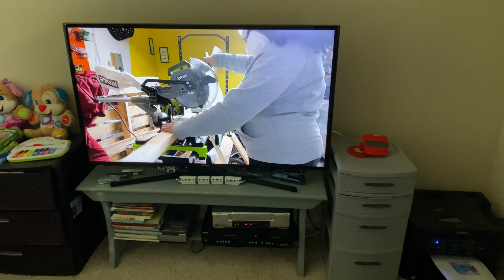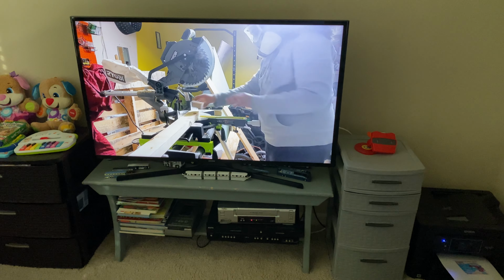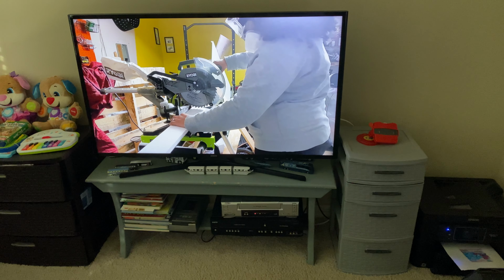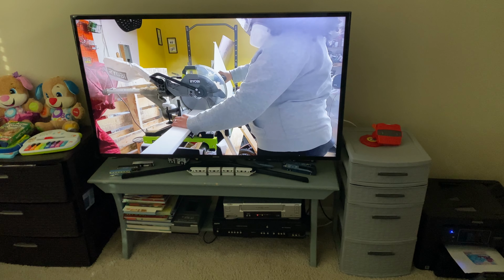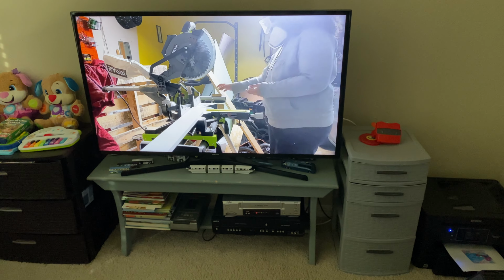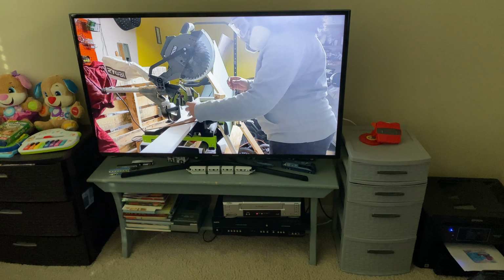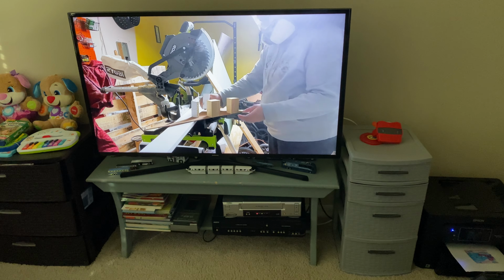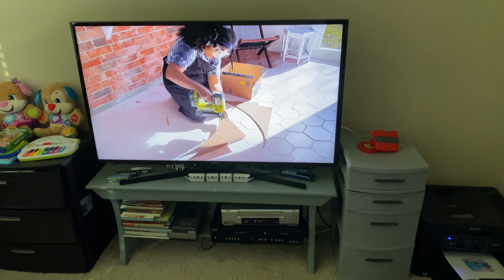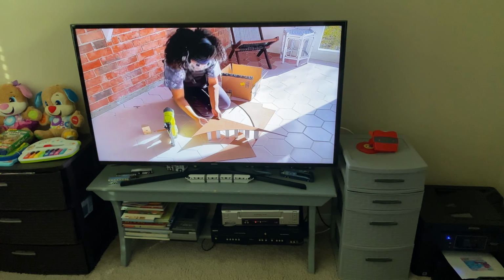I used the miter saw to cut out pieces of framing wood to create the blocks that would actually go into the studs. I then cut out the smaller blocks that actually create the arch shape. I used a 1x4 trim piece, and this was the exact width that I needed for the arch, so I just cut a whole bunch of small blocks out. Now that the blocks were cut out, I went to work attaching the hardboard to the small blocks using my brad nailer.